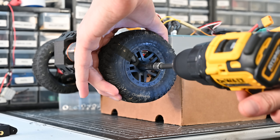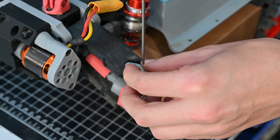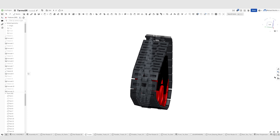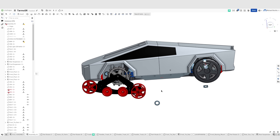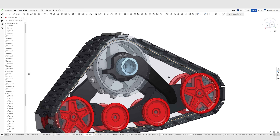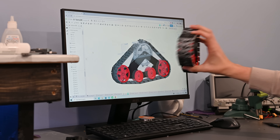Now to start the modifications, I need to get rid of these wheels. Luckily, they come off pretty easy. Next up, I need to add some tracks. The goal is to make this DIY and completely 3D printed. So I went into Onshape and started designing. This design uses one drive gear and four rollers to move the track around in a triangle shape, and hopefully it should interface with our existing car design pretty easily. A link to the full CAD in Onshape is available in the description below, and as always, it's completely free.